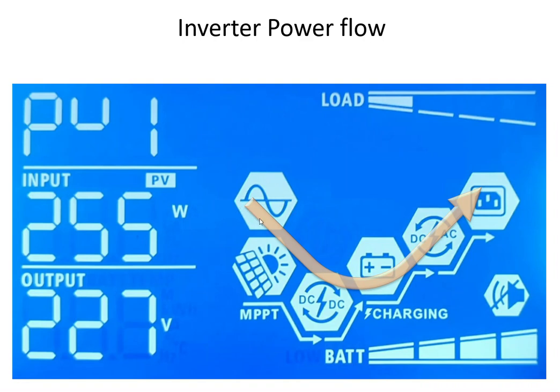Let's talk about how the inverter manages the power flowing through it. If you see the hexagon shown on the display, it means power is being fed to the inverter. That power is taken via a battery charger to the battery. When it comes out of the battery, the power goes through a DC-to-AC inverter — from battery to your normal house power — and is fed to the essential loads. The inverter measures the current it has to supply to the loads at point B, and when there's power, it controls the current at point A so it is equivalent to the power flowing at point B.